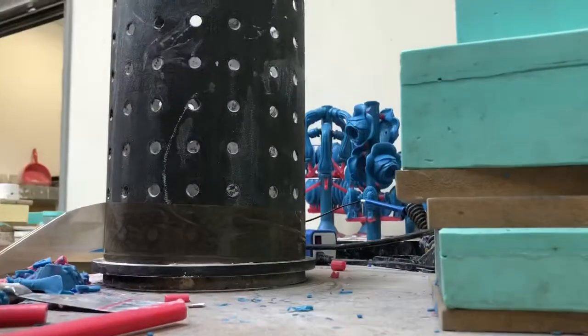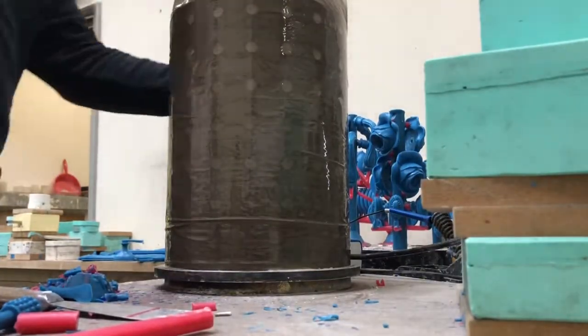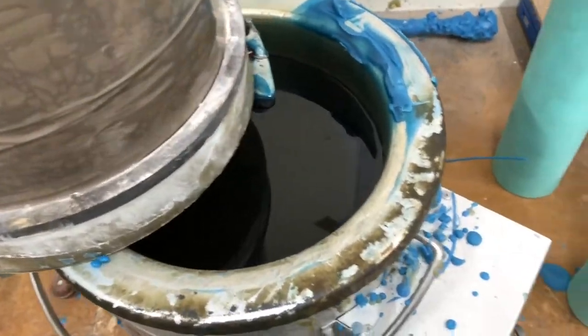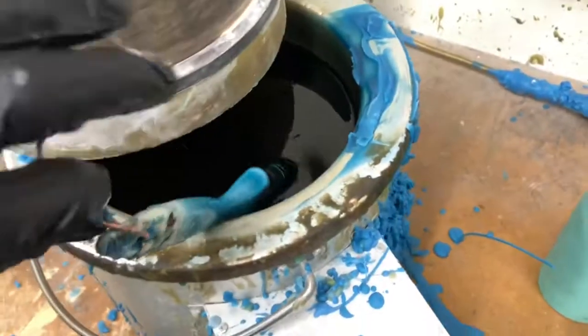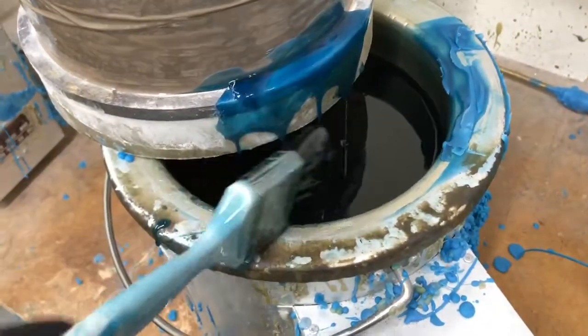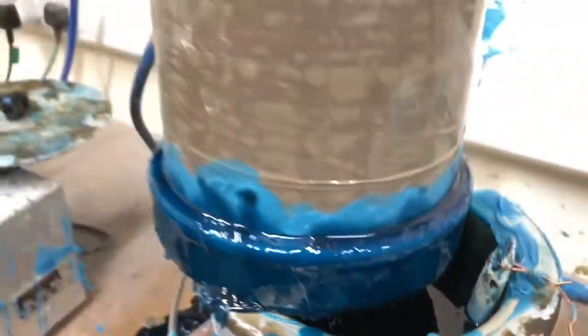These are the metal flasks that will be going on to the bases with the castings in. Before I put the metal flasks onto all of the bases I will tape up all the holes on the metal flasks — yes, this does get tedious. With the flasks taped up and the bases on the bottom, even though it's pretty tight I put wax all around the base of the flask to give it that extra airtight seal. The liquid wax acts like glue so the base is completely on there and what I'll be pouring into the flasks later will not leak out the side.